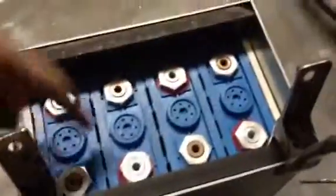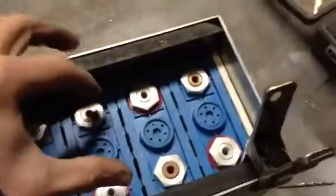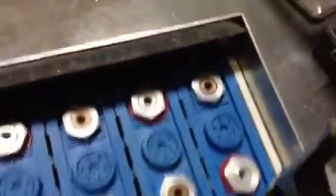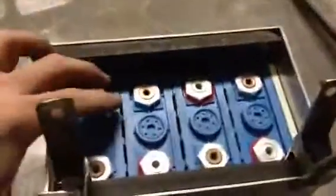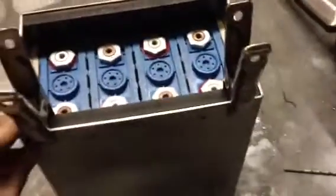I notice I'm using metal clamps. I'm not worried because I have absolutely no connections to any of the cells. The only danger is if I cross any given individual cell. Anyway, I set these to where they're pressing flush down against the cells directly. So on this side, it's perfectly flush with the can. This side's a little bit recessed. I'm not going to worry about it. What's more important to me is that it's directly pressed against the cells to hold them firmly in place.